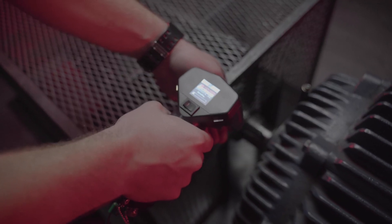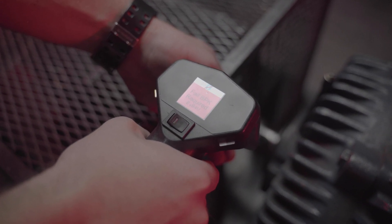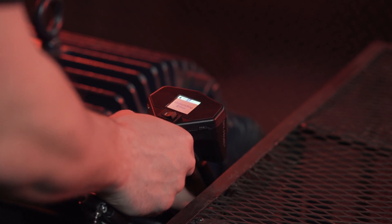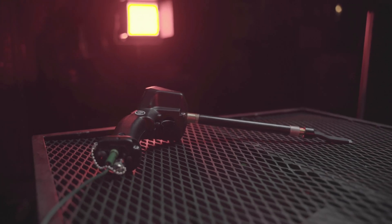By using a proprietary algorithm, the BPK Pro can determine the presence of shaft currents by testing for voltage, with anything over two volts presenting a risk to the bearings. A built-in ground error detection provides warning that an inaccurate ground source is present and will prohibit testing, preventing skewed or inaccurate test results from being reported.